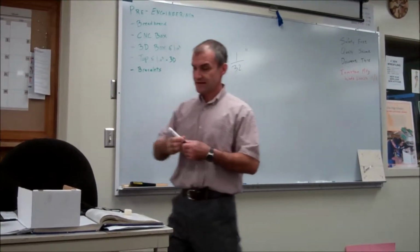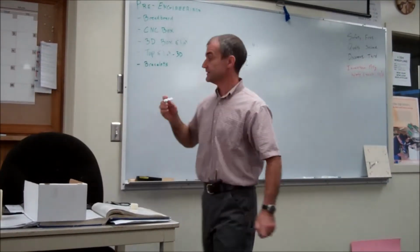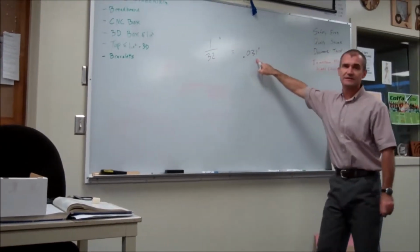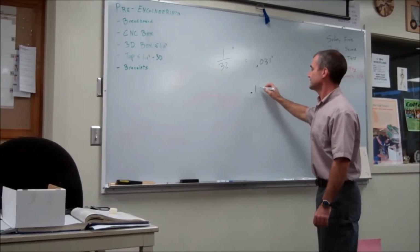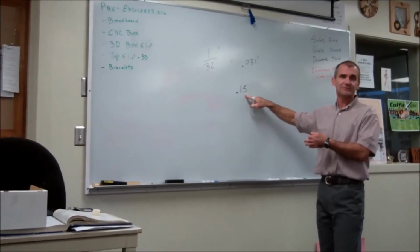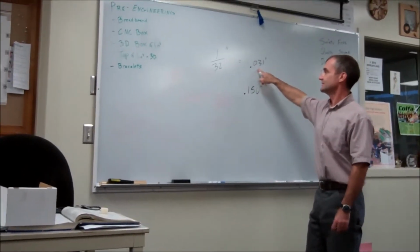So 1/32, 1 divided by 32, is 0.031. So this is equal to 0.031, and that's called 31 thousandths of an inch. Even if you have 0.15, even though that's 15 hundredths, you still talk about it as thousandths of an inch, that's 150 thousandths. Okay, so we stay fractional until about a 32nd, then we go to thousandths of an inch.